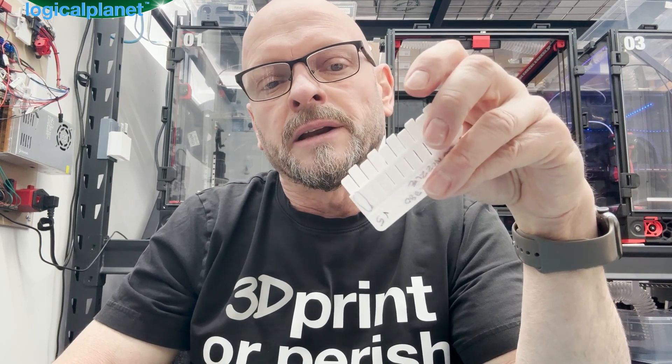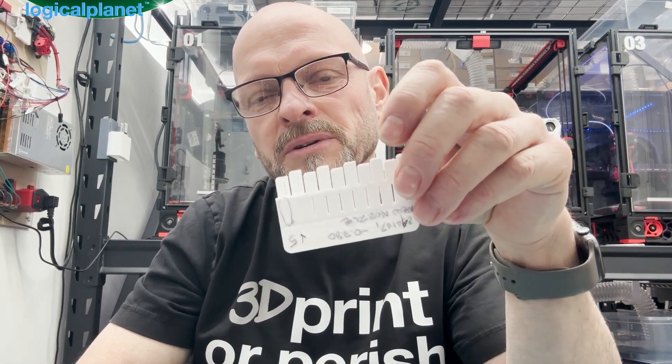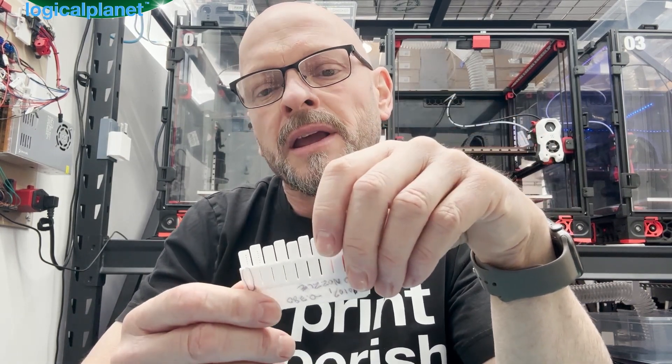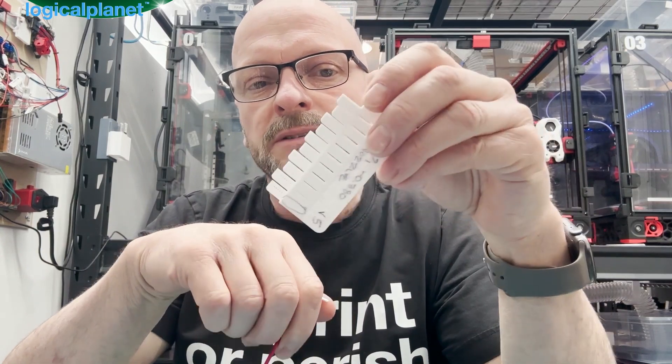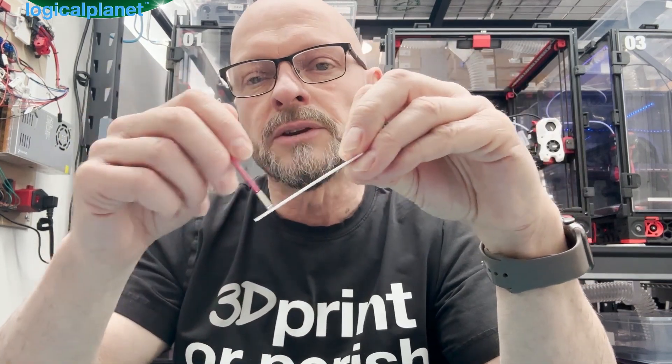Print this tool and see where you're at. If you're already down at the right setting, you're golden and didn't have the issues I had. But if you're up higher, it means you're squishing too much — you're too close to the bed. Shift it and print again to see what your print quality looks like. Your bed adhesion is probably going to be better. I'm at the stage now where I don't have to chamfer the bottom of my designs, though I still do because I like smoother corner edges. But if you need a sharp finish on the bottom, you can get it without flare-out.